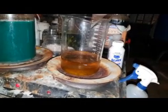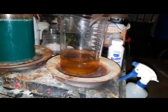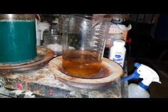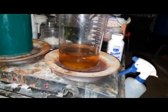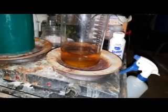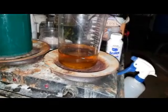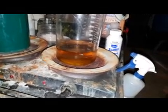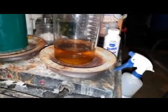However, the way I do my solutions is I either dissolve my SMB into water, which means I'm adding water when I drop it, or I use copperas, which is a liquid. So I don't need such a diluted solution. It's actually better for me to evaporate it down and then add my solutions to drop the gold. Otherwise, it's too diluted, and it can be hard if you've got a really weak diluted solution.